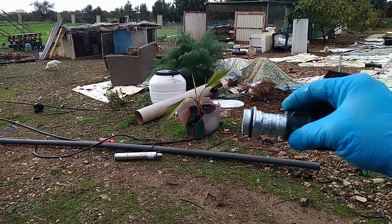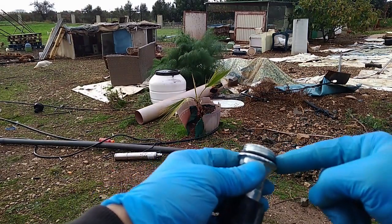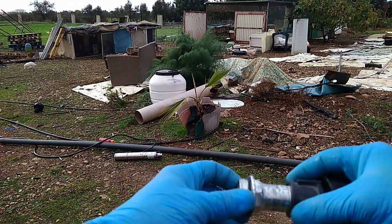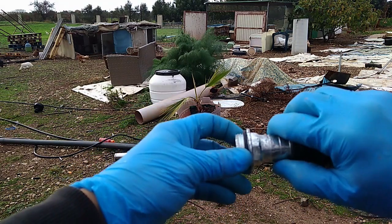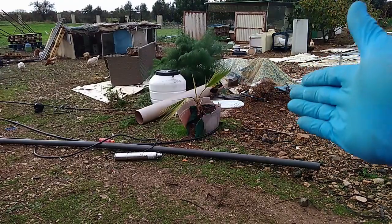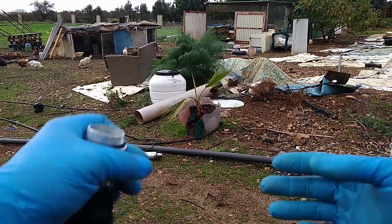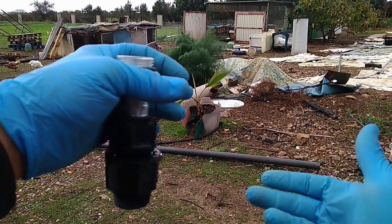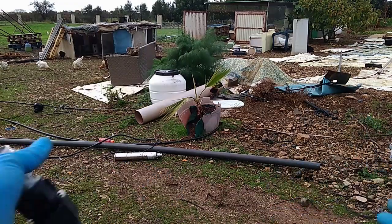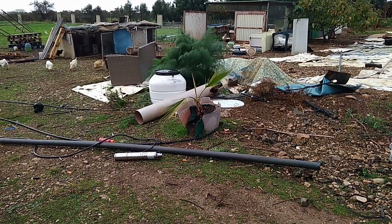One thing more worth mentioning: if you thread this, it's good to add a few drops of thread locker, and moreover, torque it properly. Give it a really strong hold, because even though this one doesn't pose such a threat, if you have a more powerful pump, they have a tendency to unscrew themselves out down there, and this is really something that you don't want, because then it's there, you know. Maybe you can pull it by the cable, but it's a big problem. Yeah.